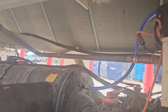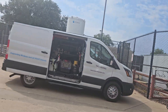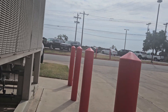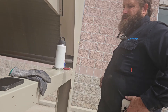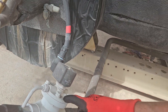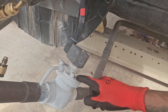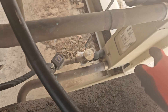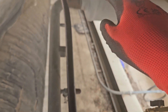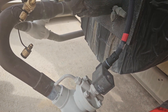Hopefully at this point you're thinking: how do you isolate it? A lot of this is only going to work if other things work - it might not always work for you. But the way I'm able to get this done is using the liquid line solenoid valve right here. I have the EEV at 100% open and the liquid line solenoid valve closed. It comes back here, out of here on the top, and that's where the other pump is. So this whole thing is predicated on this valve holding - and I'm happy to say that it is.